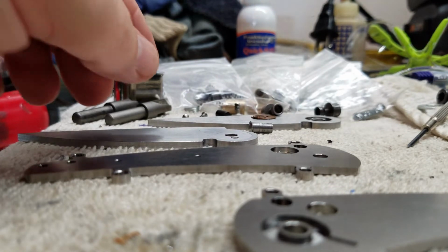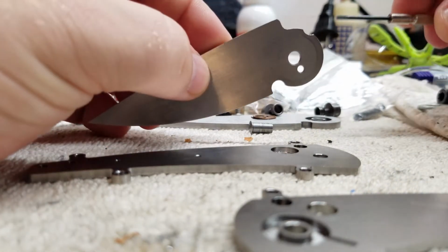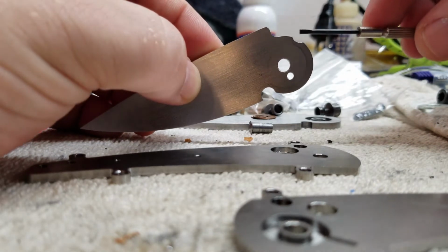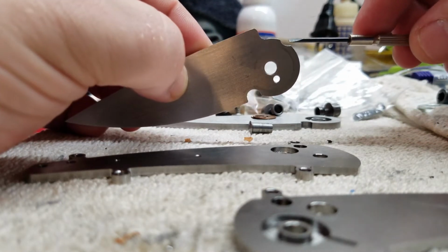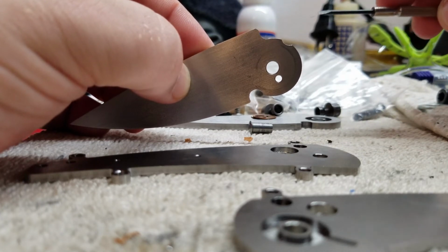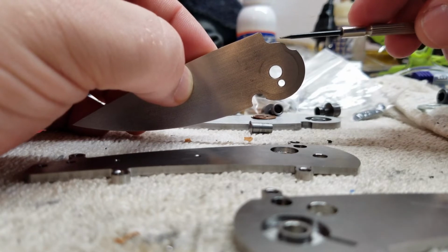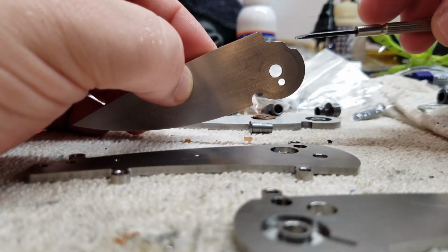And so just by moving that slot, that's going to be a little bit of a delicate process to find that sweet spot. So what I'll probably do is maybe make it a little bit shallow, and I'll machine it and put it together and test it, and then maybe slowly creep that slot. I'll start too far over.